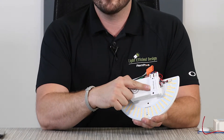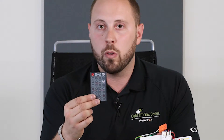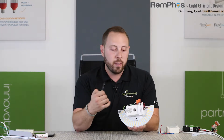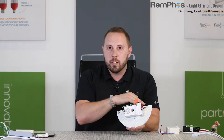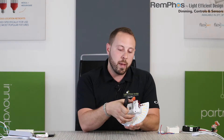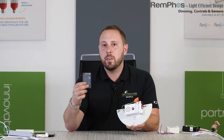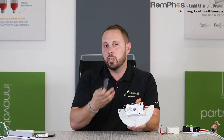The sensors come standard programmed to dim down to a 30% light level after five minutes of no motion. You can purchase one of our optional remote controls to adjust a number of different things, from your dimmed light level to your hold time — you can even have it go completely off. You can activate our smart photocell so that it holds the light off during daylight hours, or with some of our more advanced sensors it will do interactive daylight dimming, dimming down when sunlight is coming in and dimming back up when it gets darker. This remote control allows you to easily commission our basic level sensor from the floor — 10 or 20 feet away — and it works behind the lens.